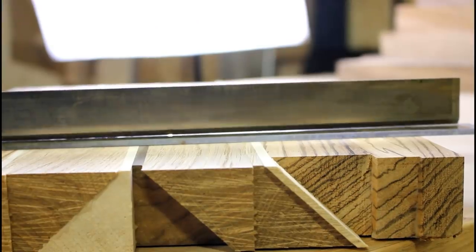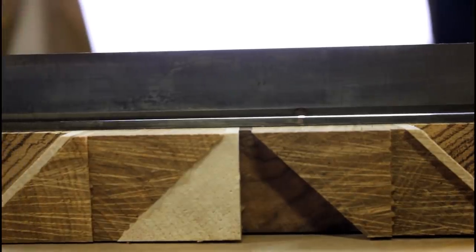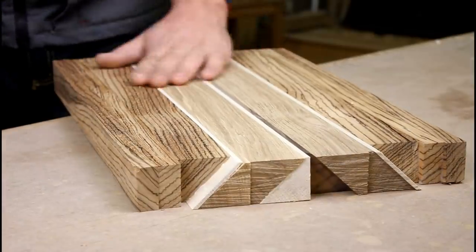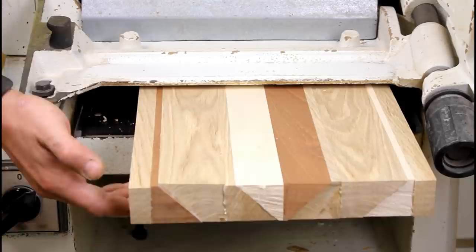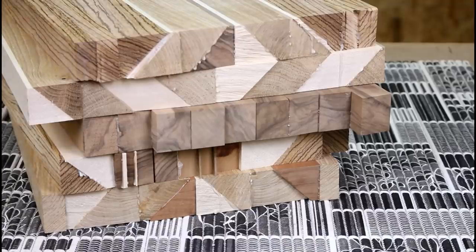Let's say for example you have 12-inch planer. And the most material that you plane is 5-6 inches wide. That means in time, planer knives won't get wear equally. And in time that creates a curve. I have a solution for that too.